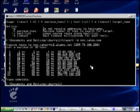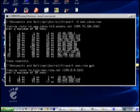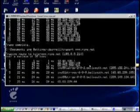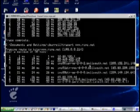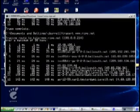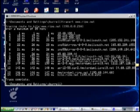You might be able to notice where one server or one hop along the way is taking an inordinate amount of time. Now these times are normal for U.S. domestic access. But let's take a look at one that goes overseas. www.ripe.net is one of the regional internet registries. This one in Europe just happens to be in Amsterdam. And here's our trace route.